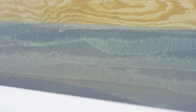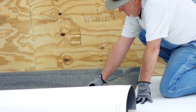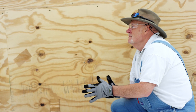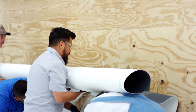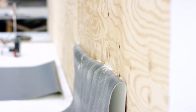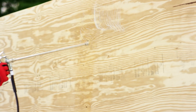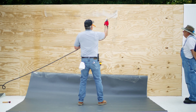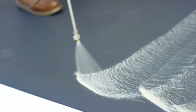If it's a concrete substrate where it soaks in more, you might have to do a kiss coat and come back for a second coat. Every job is going to be different. We got this glued up and we have about a 20-minute open time. We're in the shade here — if you were in direct sunlight, this is going to set up a lot quicker. Windy day, guys — you've got to be careful. You can see those spider webs; it's real easy for this stuff to float away. For gluing a wall flashing, especially on a repair crew, this is the way to go.